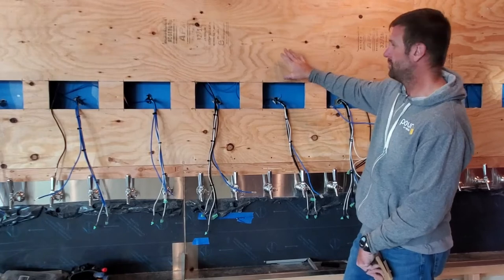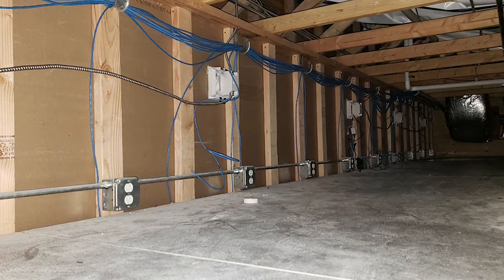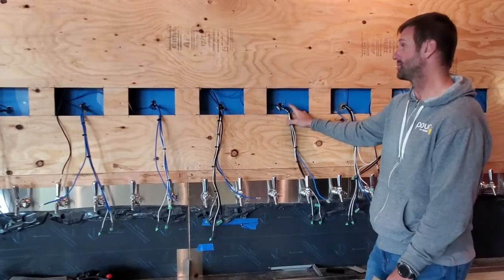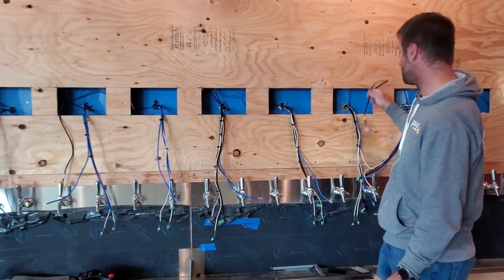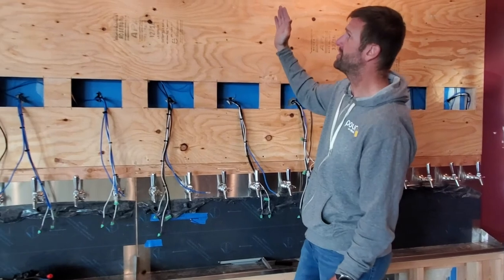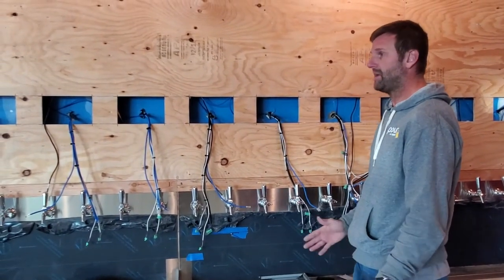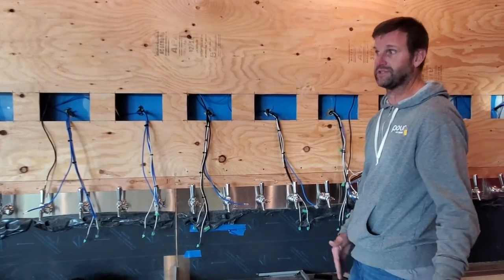Keeping power within six feet of the screens is important. The leads on the transformers are about six feet to a receptacle, and then we end up fishing power wires down through the wall on the other end, so keeping those within six feet of the screens is important. How many receptacles or outlets you have really depends on the size of your tap wall.